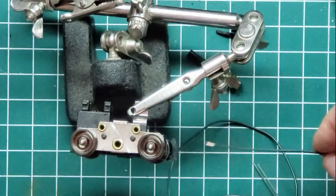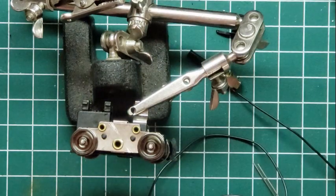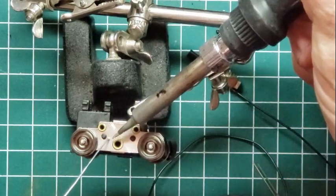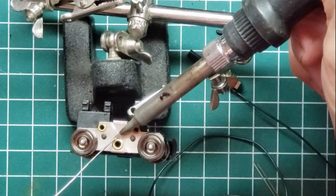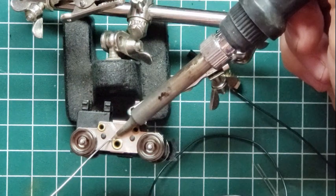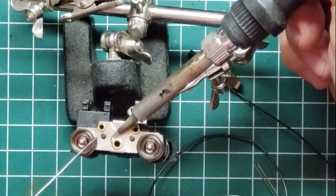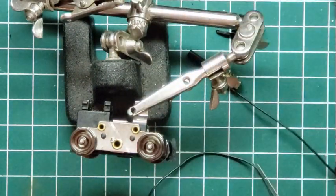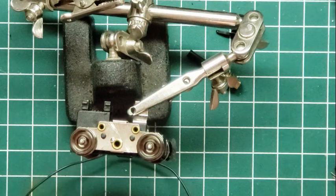You want to tin the frame — you may want to turn your soldering iron up a little bit. We're just going to tin the edge where I'm going to put the wire, right here. It's going to stick to the brass pretty quickly, to this brass rivet. The heat needs to be up because it's a big piece of metal. You can see it sticks pretty good. I can't leave it sticking up like that — turn your work around where you can work on it.